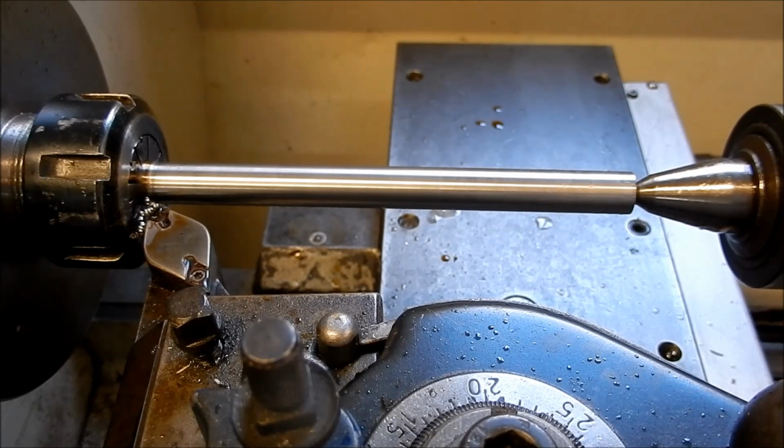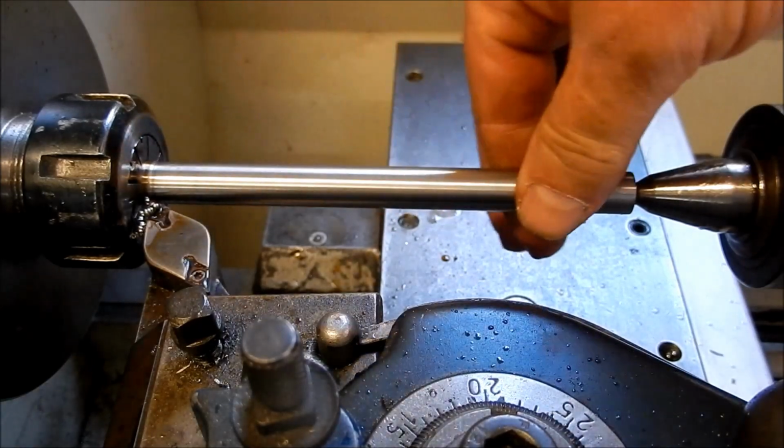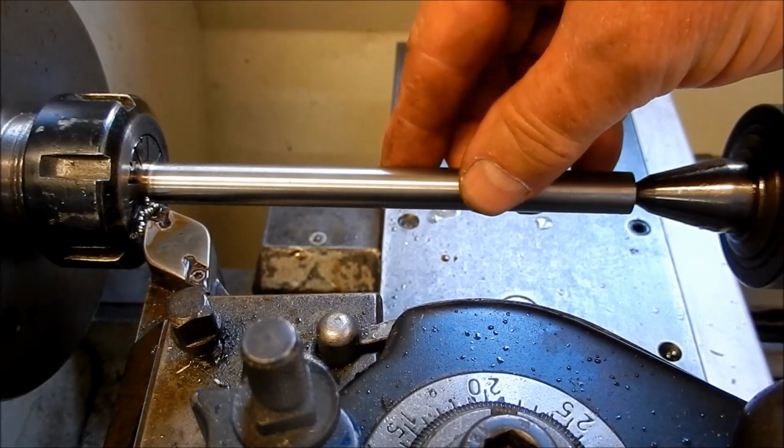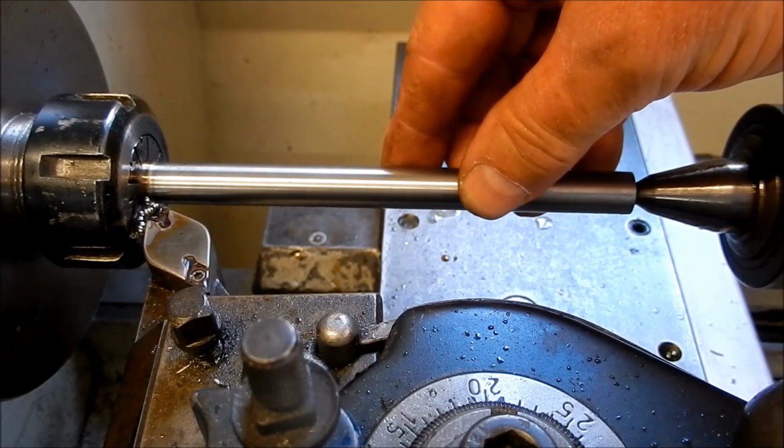That's perfect. As I said, these are only stays, and I'll be boring the holes into the firebox outer wrapper to size, and then the inner firebox wrapper gets tapped 1/8 BSP parallel to screw these into. Alright, I'll continue on. I'll get the rest of this stock down to size, then we can start looking at machining up some parts.